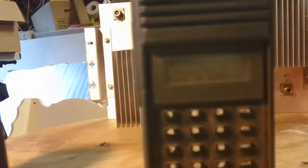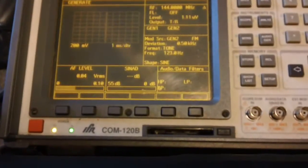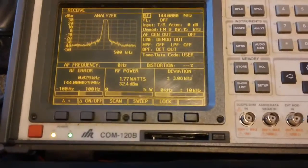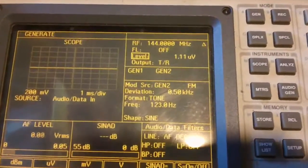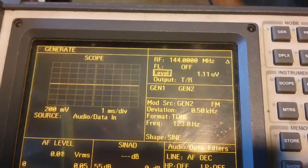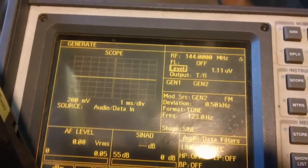Let's test this out. I'm hooked up to my test equipment with 144 MHz tuned in — the same radio — boom, two watts coming out. Let me turn down the volume: test, test, five, four, three — deviation looks okay. It's working. Let me generate a tone and check reception. I have to tune the receive in a bit because it sounds bad with that signal level going in; I need to tune it to receive efficiently, but it is working.